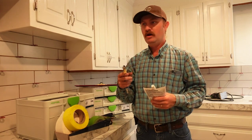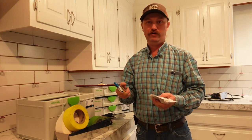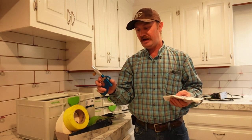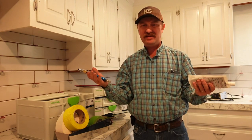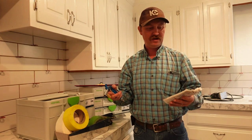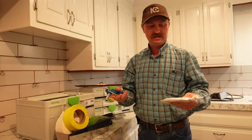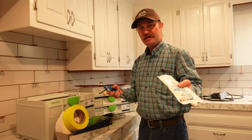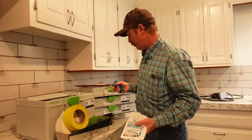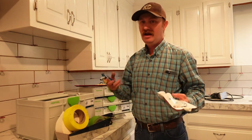Really nice when you're working on rentals and maybe just have a doorknob hole in the wall or any kind of little hole somebody punched — happens every day. I use this, shoot it on the wall really fast, and this texture dries probably in less than an hour on a typical repair. If you put a fan on it, it would be even faster. It's already mixed to the right consistency in the bag — shoot it on, give it about five minutes, then knock it down with that Magic Trowel and the finish is just fantastic.